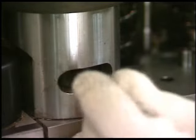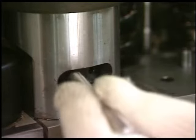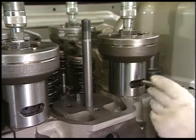To remove the tightening nuts of cylinder head bolts, insert the exclusive turning bar in the notch of spacer and loosen it counterclockwise by about 7 or 8 turns. In doing so, be careful not to damage the tightening nuts and the screw of cylinder head bolt.